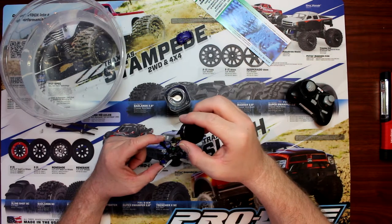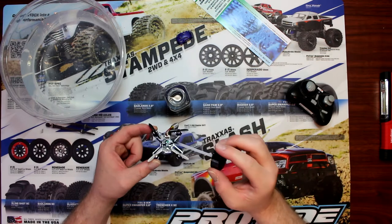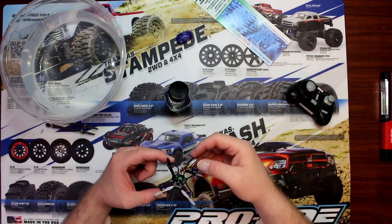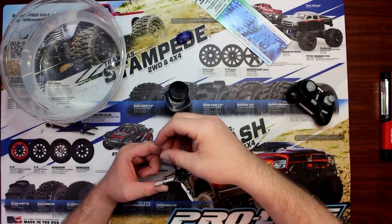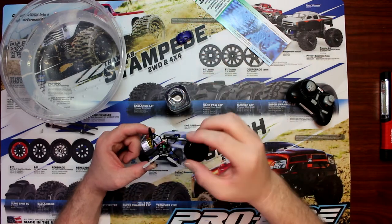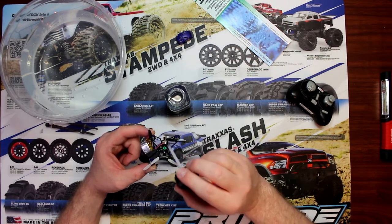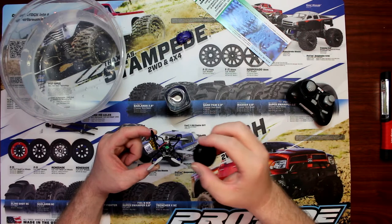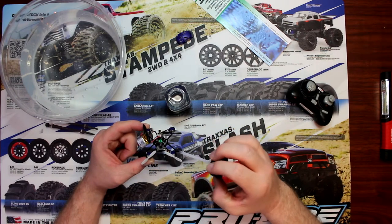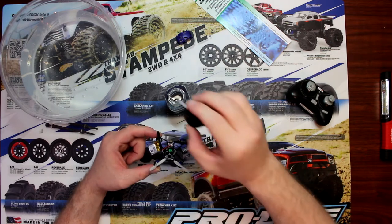The other thing I'm going to do is cover where you charge it and go around the battery connector. I'm going to put on a very thick layer. There are other ways to do this, but again, what's fun about conformal coating is you can see it with the black light where you put it.